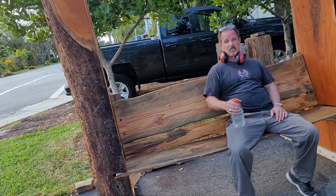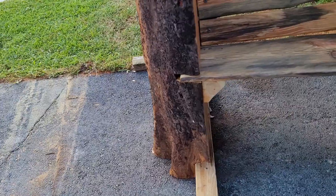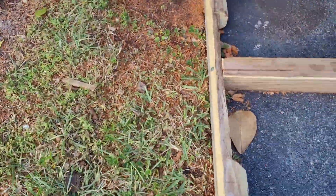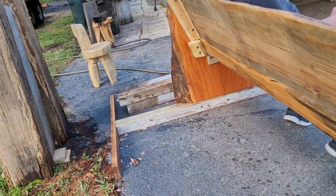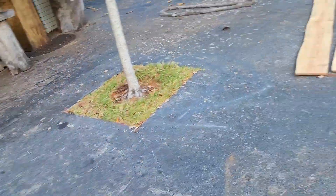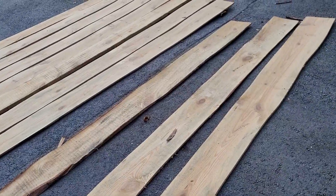We're going to run a super big beam through the top above the roof line to support the two all the way through — the bobcat will pick it up in the center — and then two beams at the bottom, slightly smaller, one in the front and one in the back, that are going to go completely through. So it'll have three beams total just to hold it up side to side. I've got four-by-fours kind of counter-sunk into it just to keep the stability up. The roof's going to come up and way around, there's going to be a cot hidden back here that you can lay down — concealed. I'll just overlap the milled boards for the roof and keep it simple. Thanks for watching.